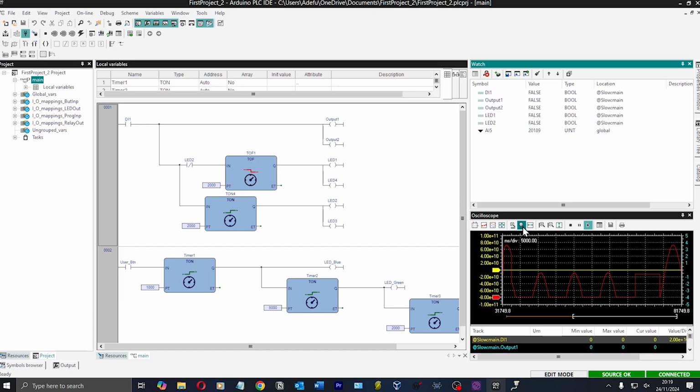But anyways, look how cool this is. This is just so cool that it just works. So yeah, okay, it is a DC offset. You can see there, now instead of a perfect 50% duty cycle, I've now got an 80-something percent duty cycle. I wonder if there are tools to be able to display that on here. I don't know. I haven't really looked at it.